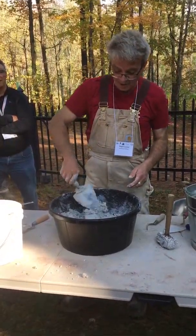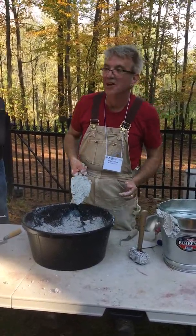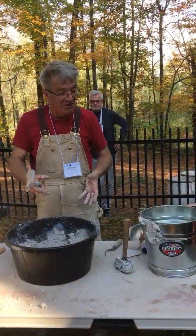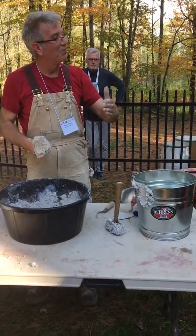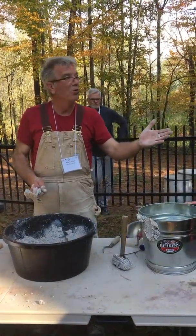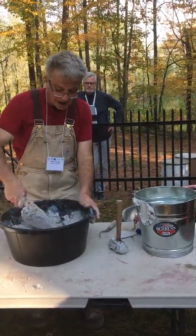You can imagine we butter a perp joint, and let's see if it'll stick on a metal bucket, and it stays there. It doesn't just slide down and become a nuisance. You glide your stone in if you're bedding it, and it impacts and compresses, and there you go, it's done. So these are all little incidental benefits, but they're what we want, aren't they? That's as masons, talking to a fellow mason over here.